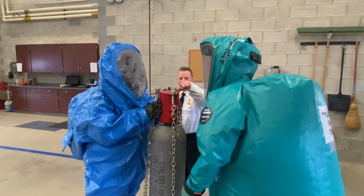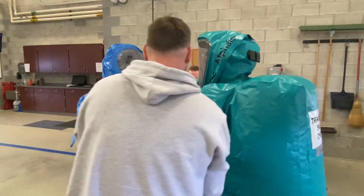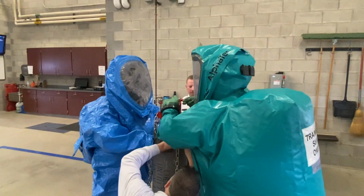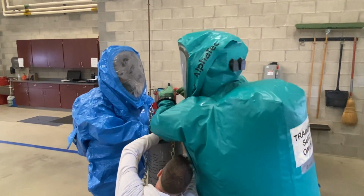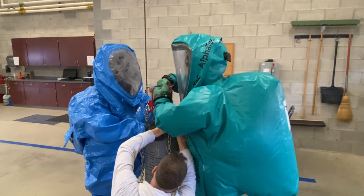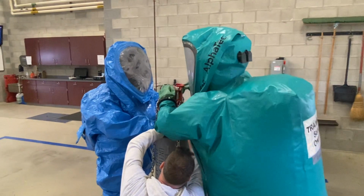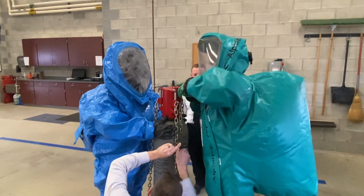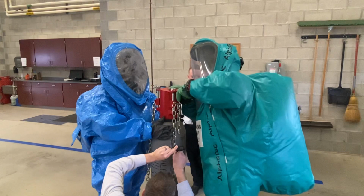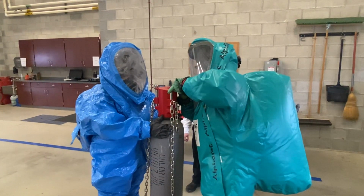Alright, so lastly what you want to do is take your wrench and just tighten it down all the way. You're going to do all 3 of them. So do a couple turns there, then go to the next one. Because you don't want to do just one at a time, because if not it'll all come off set and you won't be able to get a seal. Alright, now go on to your next one.